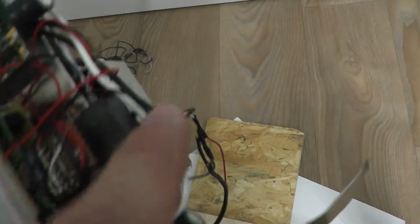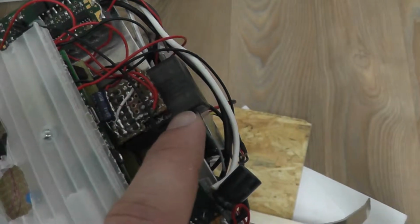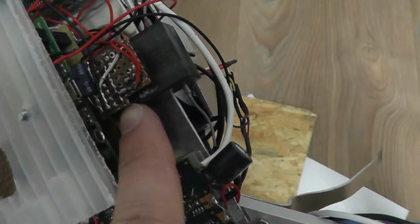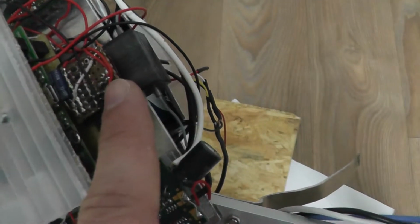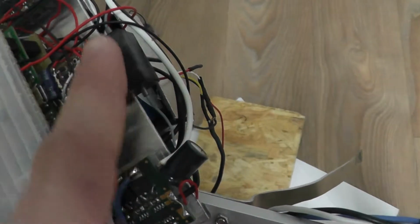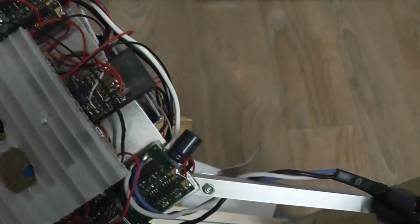What you see here is the RC receiver for the RC control. In this case, it's the AR6210, which is from the company Spektrum, which also sells RC controls, which I will get later too. The little switchboard on it is very important here, because I wanted to use a PPM sum signal to feed the signal from the RC control into my microcontroller. But the problem is, this one doesn't feature it, so I had to manually make this myself out of the servo signals.